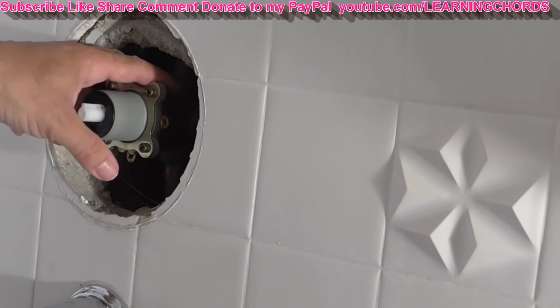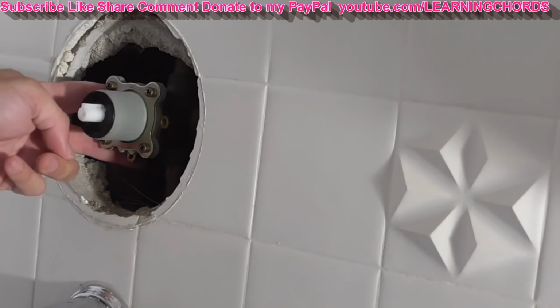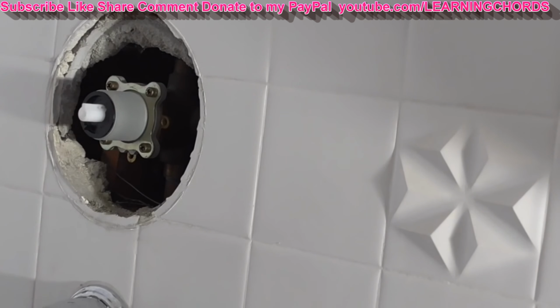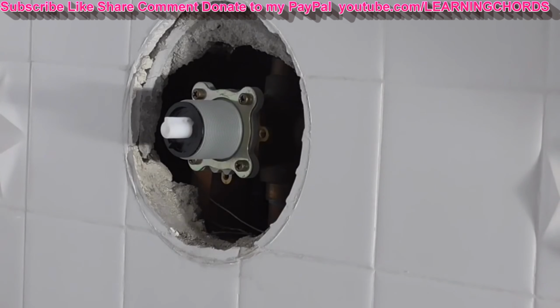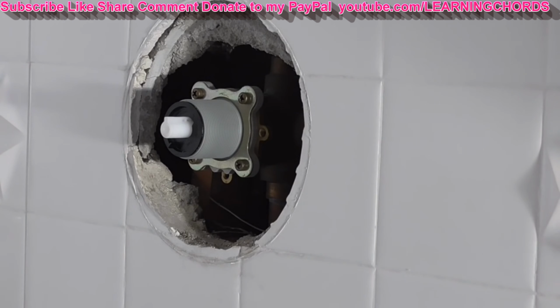You never want to have leakage. Definitely leakage is a bad thing in life. And if everything works out good, then the project's almost finished. Always remember when you turn the water on from the main supply, not from here, but from outside, turn it on slowly. If you turn it on really fast, you could blow your pipes out from the pressure. If you can, open up one faucet to let some water drain and to get some of the pressure out of the system. I'm going to turn on a sink.